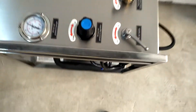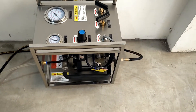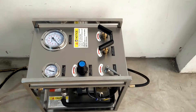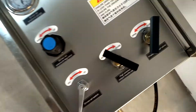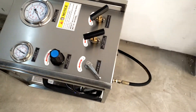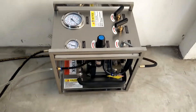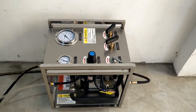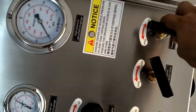Close the driven air switch, close the liquid gas source cylinder inlet valve, and close the high-pressure outlet needle valve. When all the injection work is completed, open the relief needle valve to release the pressure. Open the high-pressure outlet needle valve to release all the pressure in the pump and pipeline. Be sure to release all high pressure in the equipment and the high-pressure pipe before removing any pipeline.